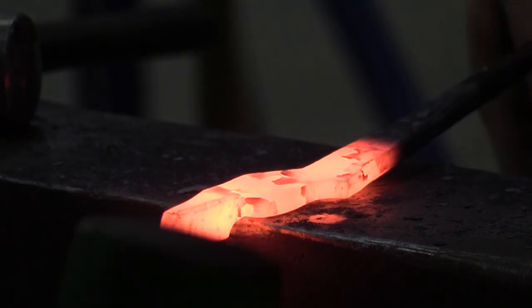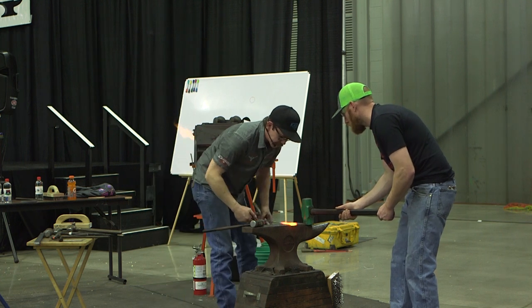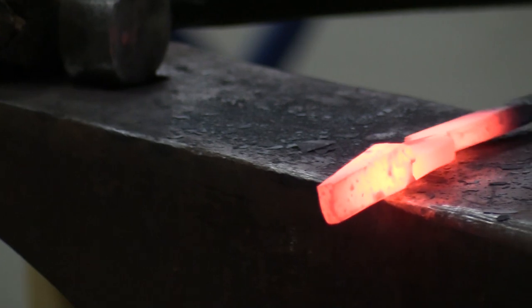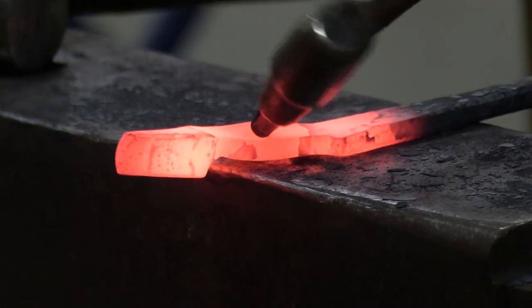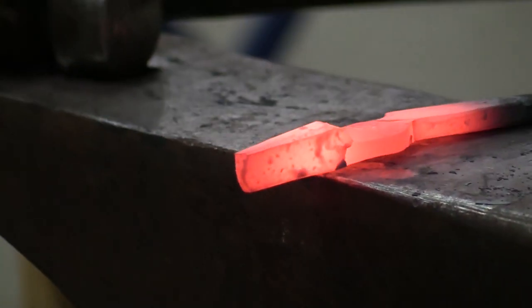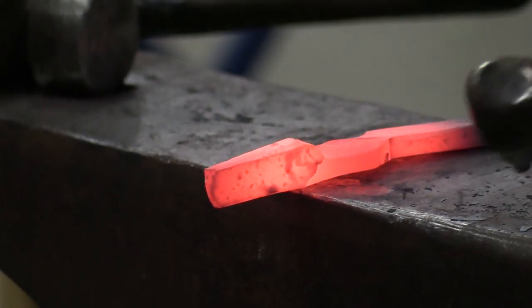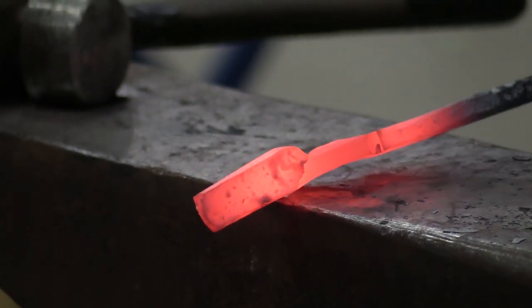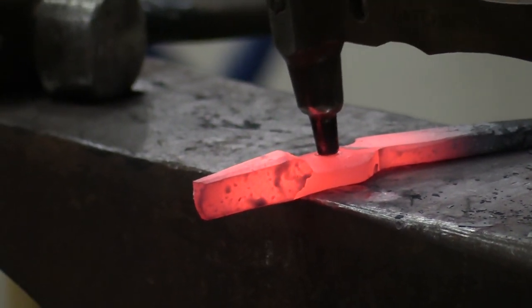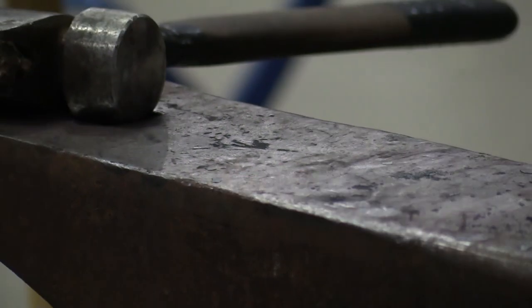Well, other things, I know I'm not that good at making a round object. Craig was talking about earlier, a circle is the hardest thing to get. Everybody thinks they know what it is, but it's really hard to get a nice circle. And so that's why I move my stud punch around, because it's kind of correcting itself as it goes. But I got to go ahead and flatten at that point. I think it washes my mark out. My mark gets kind of big. So I go ahead and leave it up. I think I have a nice shiny mark.